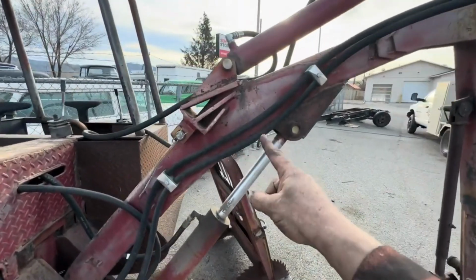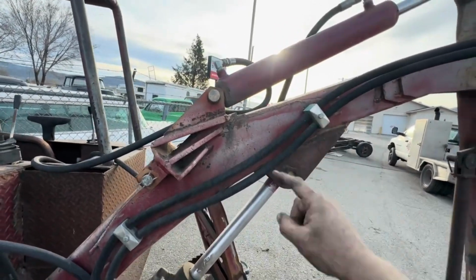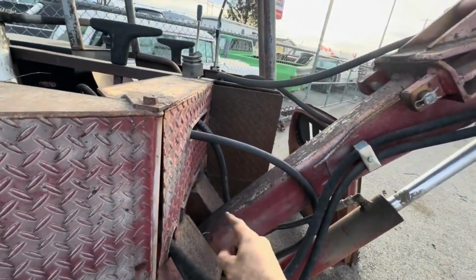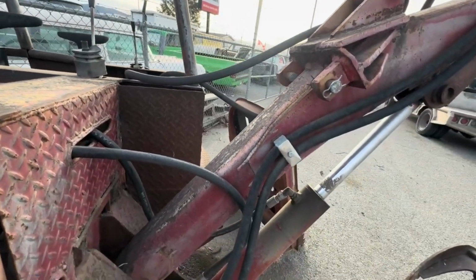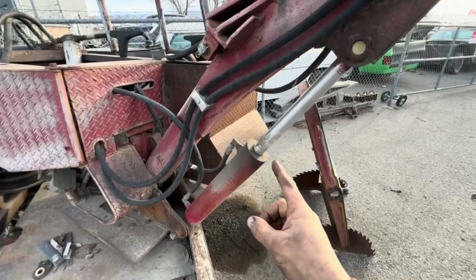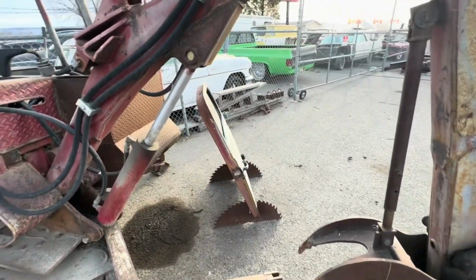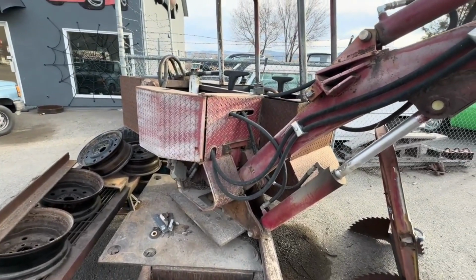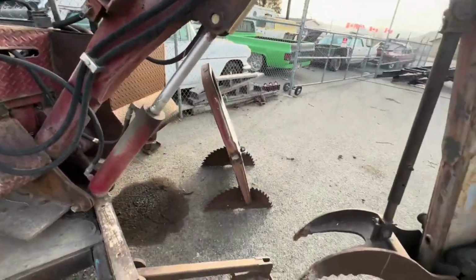And I ended up cutting it here, giving it this angle, and then putting doubler plates on the side. Originally, I had 2 cylinders here, and on the other side, they were a little bit smaller cylinders. It worked well, but I wanted it to look more like a regular excavator, and I thought it might speed it up if I only had 1 cylinder. So this thing was always a little bit slow in the hydraulic compartment. I didn't have a big enough pump and motor back there, but it worked.